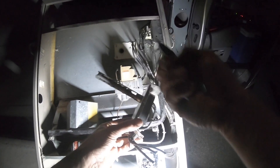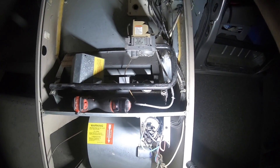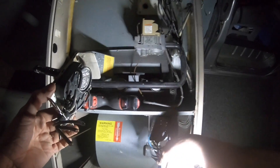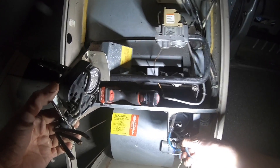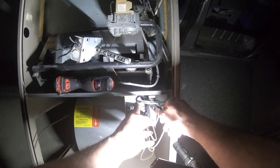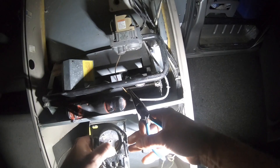This was the good old days. And then you get the old timers saying, 'You would never survive in my day.' Okay, whatever. Seriously — you got a gas valve, maybe it goes bad. You get a bad fan relay, maybe that goes bad. There's nothing here. So what is the hardest thing to troubleshoot here? A relay? It either makes or breaks with power — intermittent problems are not really a problem. It either makes or breaks with the thermal disc heating up and turning on the unit.